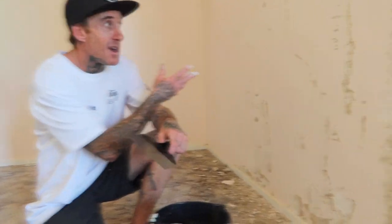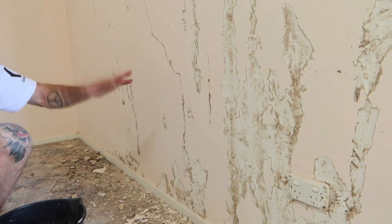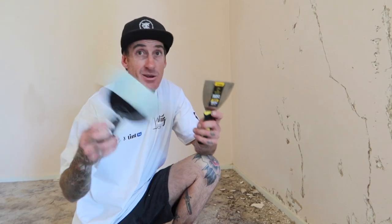So I'm just going to go through now. Any walls like this, you pretty much just go straight over with a base coat — there's not much else you can do with them, you can't tape them, you can't do anything with it. So we're just going to apply a nice skim coat on. We do have a set of wider blades but we just can't find them at the moment — these from the hardware will do the job. You could use a barbecue spatula, anything that's going to fill the wall is going to work. It's also good to show this is a DIY-appropriate application.